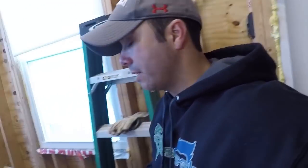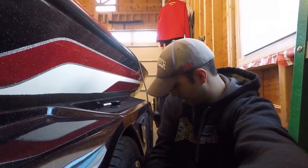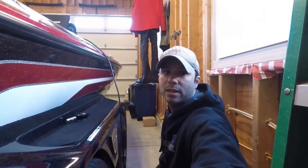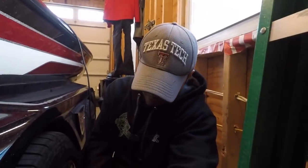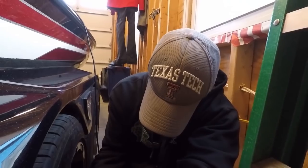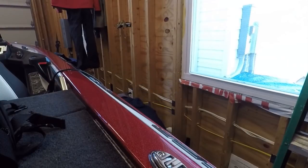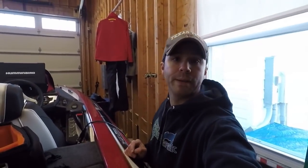Let's get over here and check these tires. The ratings are going to be on the side of the tire - most times I think it's about 50 PSI, let me check that. Yeah, 50 PSI is exactly what we should have. We've been having cold weather here recently, so I expected to see anywhere from 40 on up to 50. That was right at 40, and another one was at 39. The synopsis is we gotta put some air in these tires.